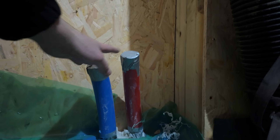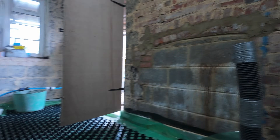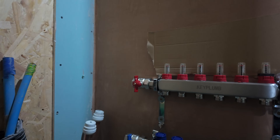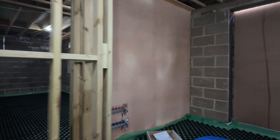The plant room will go in this little niche here — that's where the cylinder will go. We've got our manifolds on the wall: two six-port manifolds, so 12 ports across 460 square meters. Here you can see I've run my MLCP under the insulation. Those are primers going to the outside, right there to where the heat pump will go. This MLCP here, connected to copper, goes to another manifold. In the future there'll be a T connected to this manifold going from the main flow and return.